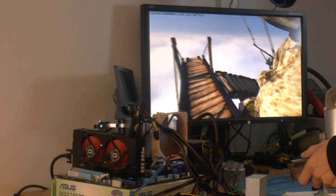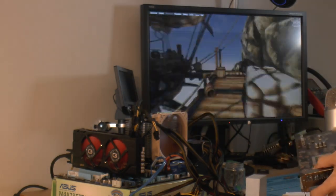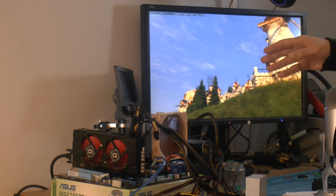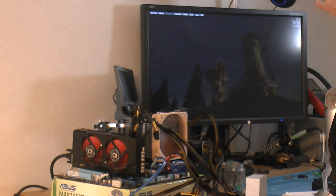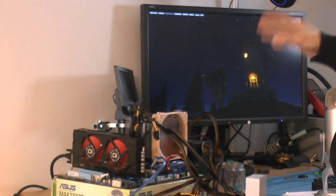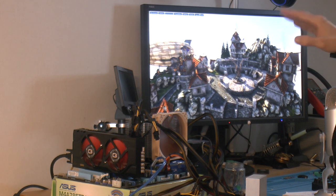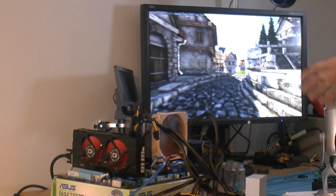So that effectively means we should replace the GPU. Now I don't have one, and I'm not sure I could actually do it successfully. I'm not gonna try to find a GPU for that. I mean, these cards aren't really worth it. I figure if it can run overnight, which I'm gonna test now, then we take it apart again, and the pads kind of broke and squished out. I want new pads and make sure everything is really clean and nice. And if it worked after that again, it can be a test card.